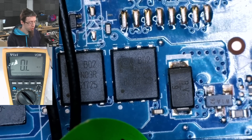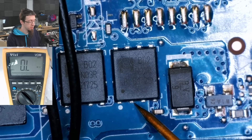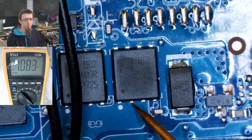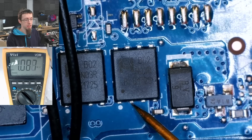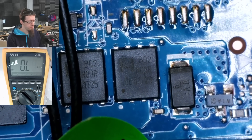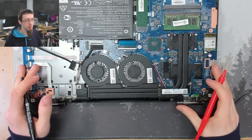Let's then check the output of that — down here where the signal exits these DC MOSFETs. We've also got 1.08 megaohms. So again, there's no direct short at the output from the DC circuit. The next thing I want to do is look around the secondary power supplies in the laptop.